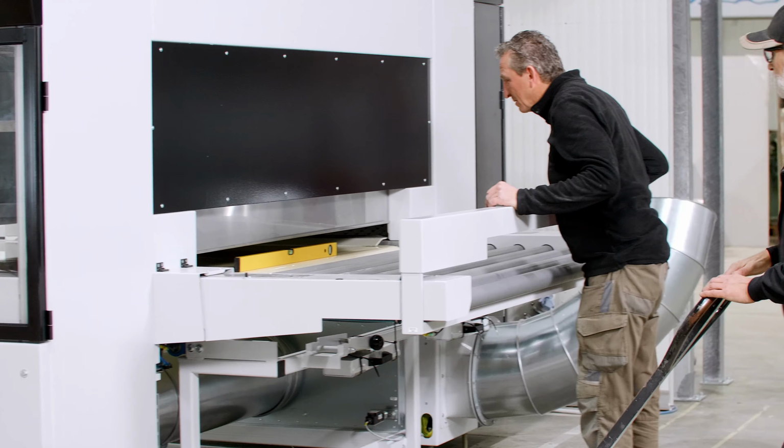We'll show you now. Since we have just aligned the booth, we are now taking care of the paper handling. We need this guide for the paper roll trolley. You can simply slide the guide directly onto the bracket provided on the floor. We have already supplied 2 screws for you. Simply unscrew them and secure the bracket with them. That's about it. As you can see, very easy. I think anyone can do it.